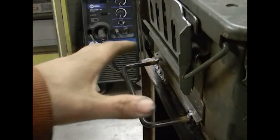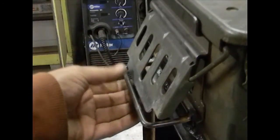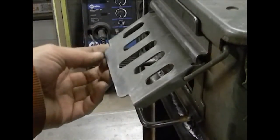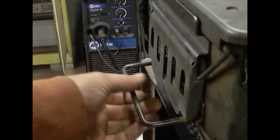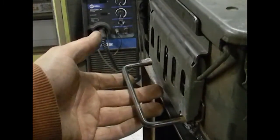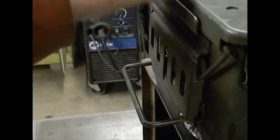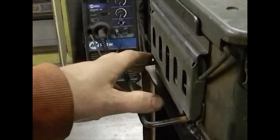What I've done here is welded the handle in place, and that'll basically just stay out of the way of the door. But doing that means I had to shorten the latch piece so it actually clears. This handle would not allow this latch to close if it were all the way up. In the last clip, you saw me removing a little bit of material from the bottom of this so the lid will, in fact, close back onto the ammo can. This is a very loose fit right now because the gasket is still missing and I haven't installed the fire braid yet. Once the fire braid's in there, you'll actually have the nice locking action and a good seal for the stove.